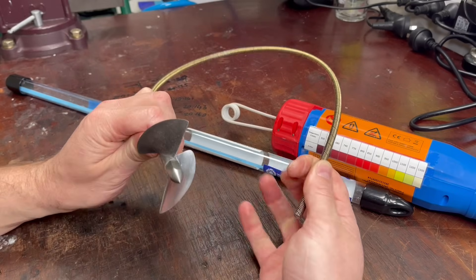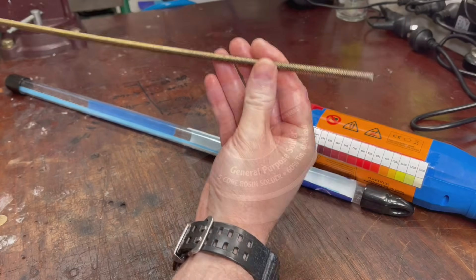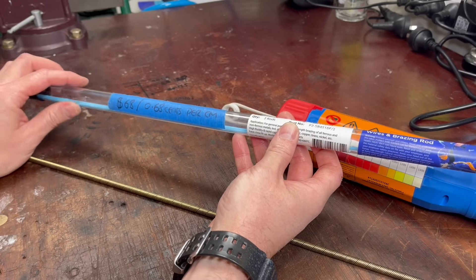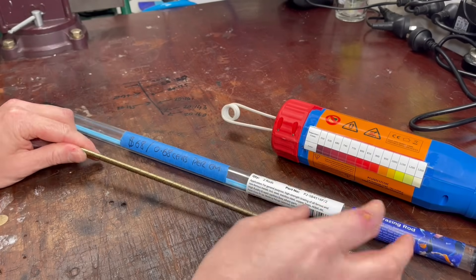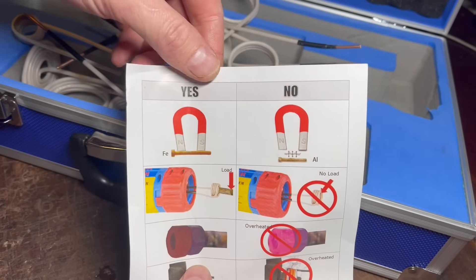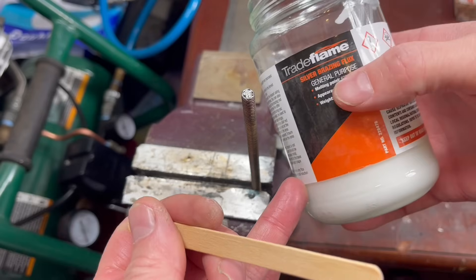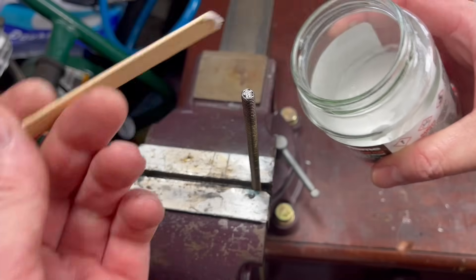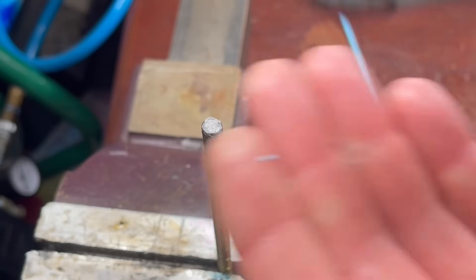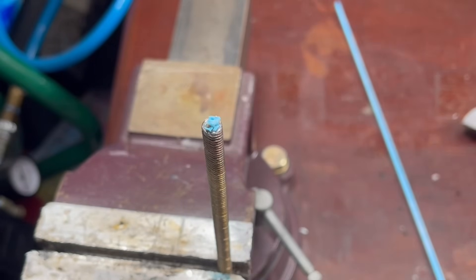The first test is brazing a drive cable for an RC boat that's started to unwrap on me. I tried tin solder and that didn't work, but I recently bought some 45% silver brazing rods and we'll see if the induction heater can heat this cable up and melt them. The fact that this tool only works with ferrous metals means you can only heat the drive cable itself, and the brazing rods will melt when the temperature reaches its critical point. I've applied silver brazing flux and placed a small piece of silver solder on top, giving me two hands on the induction heater for more control.